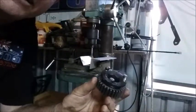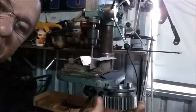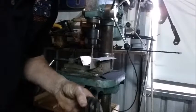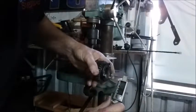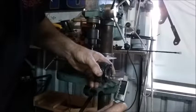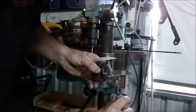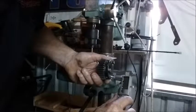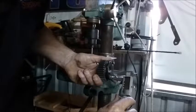So we can see, I don't know whether you can see it on the camera, but you can see the slightest little back cut. So then we grab the verniers, probably easiest to go this way on the full end of the dog, so we get the exact reading on the top of them. Close it. You can actually see when you put the verniers down, you can see the tiniest little gap at the bottom. So that's what we're chasing. It's 10.9. It's got to come down a little bit.